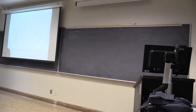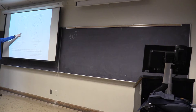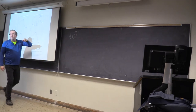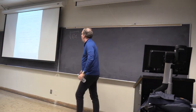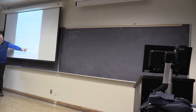But now let's focus on another key property that is very testable, and that is the curvature here. If you deconvolve this, you can determine that the curvature is inversely proportional to the effective mass, and the effective mass allows us to do the calculations. The effective mass, m star, is 1 over the curvature of the E-k diagram.